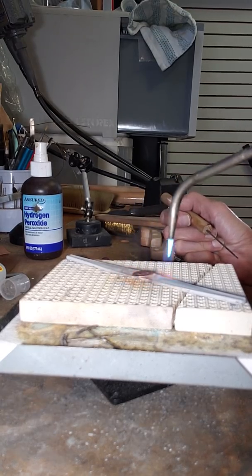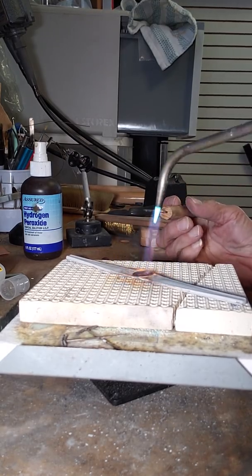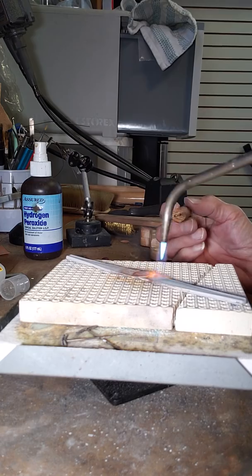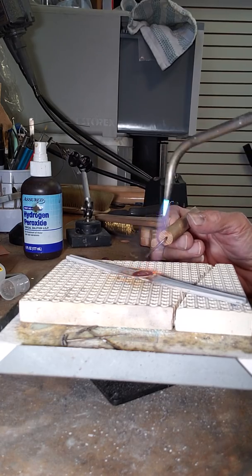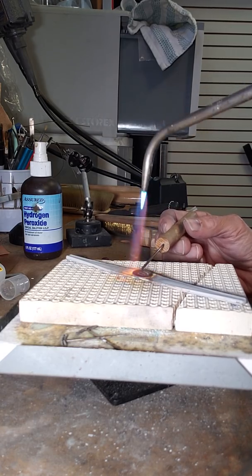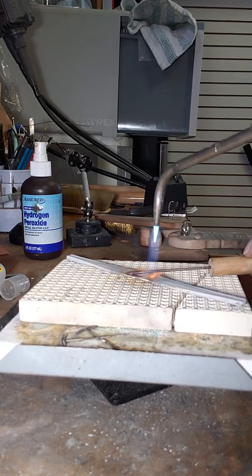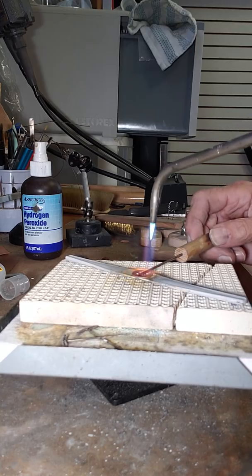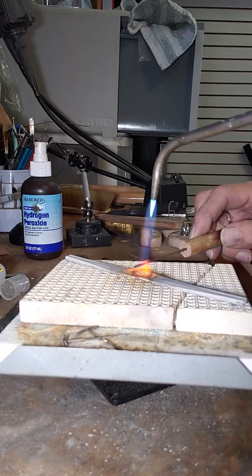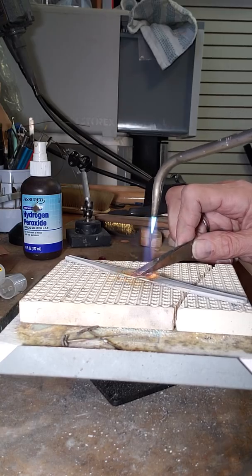There's a saying in soldering, if it's not glowing, it ain't flowing, which means if your metal isn't red hot, your solder isn't going to flow. The disc is getting nice and red hot. We're getting there. You also have to make sure you're not going to overheat past the temperature that's going to flow for the disc, or you're going to break your medium solder seam. Right, I'm getting there. Use a tweezer, push that down.